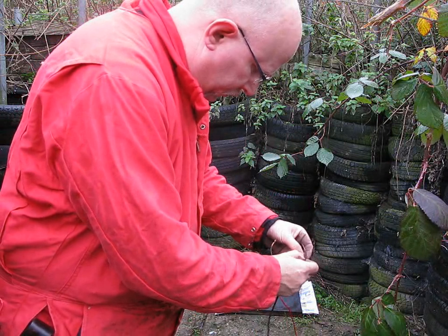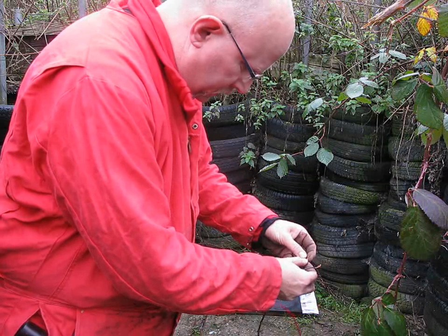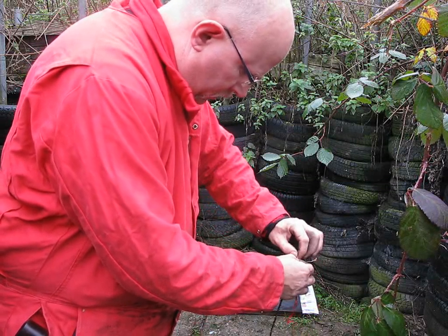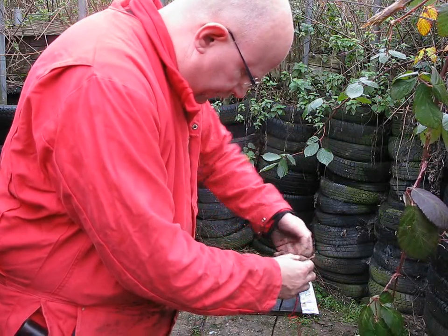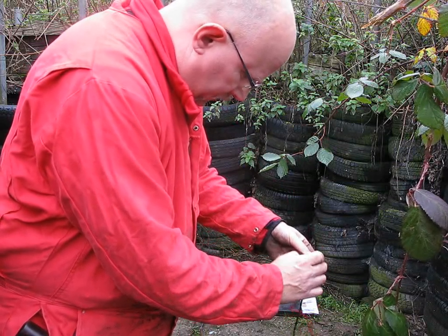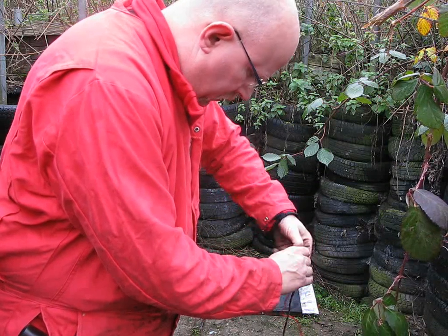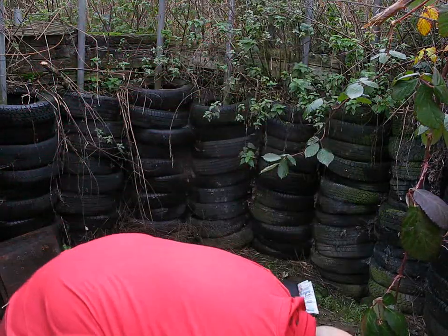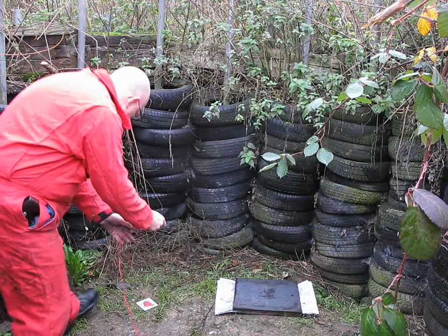So keep everything shorted out as long as possible. Make sure everything is neutral and equalised. And then twist that bit on there. Close it all again. Twist the other end on there. Keep the two ends apart so they don't short out. And now I can insert the detonator into the actual charge.